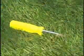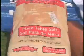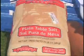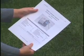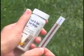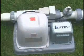You will also need a straight bit screwdriver if clamps are used, a GFCI type electrical outlet, and table salt which can be purchased at quantity warehouse grocery stores. Refer to the salt table in the manual for the amount needed based on your pool size. You may also wish to purchase salt test strips from your pool store for salinity testing. Let's take a quick look at the key parts of the generator.